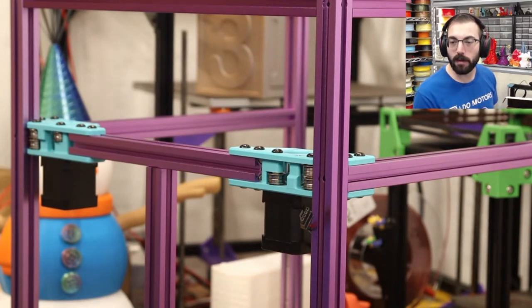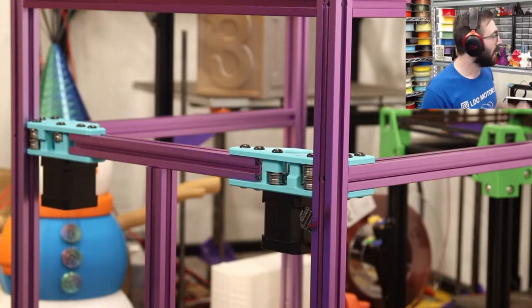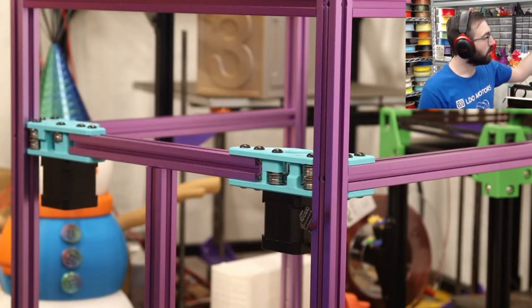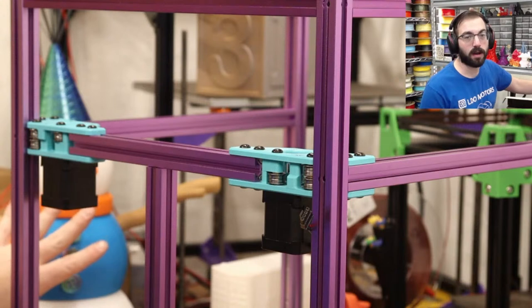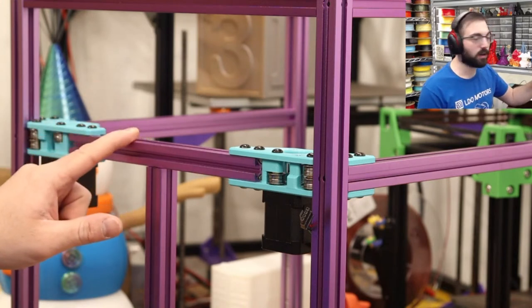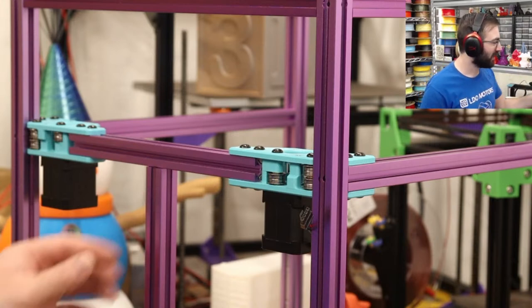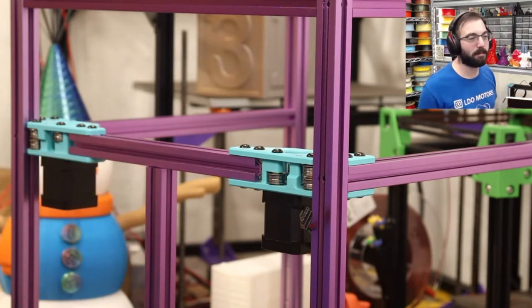V2 prints at the bottom, not top. For a larger printer, you expect all the roll and yaw might contribute to more ringing. Yes, absolutely. This big printer behind me, because it's up, it definitely vibrates more. As you get to the bottom, the top of the frame is vibrating differently than the bottom because of that center of mass shift. But this is a similar situation on the 2.4, so I don't know. Just use a stiff frame.